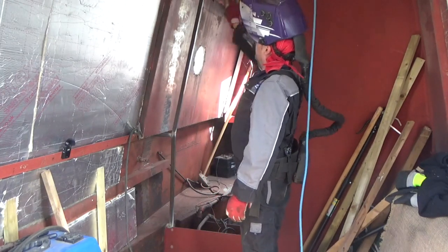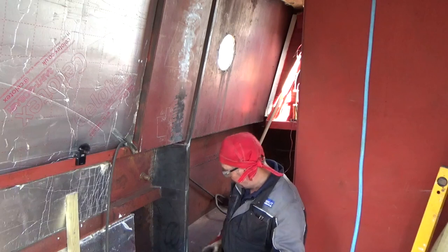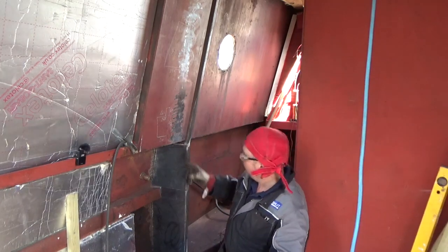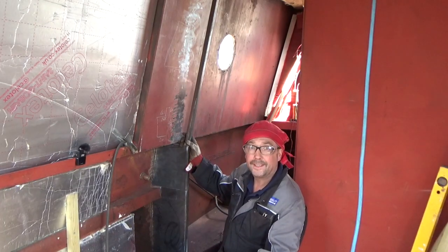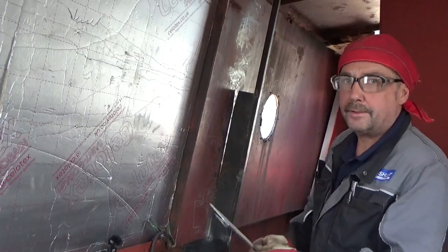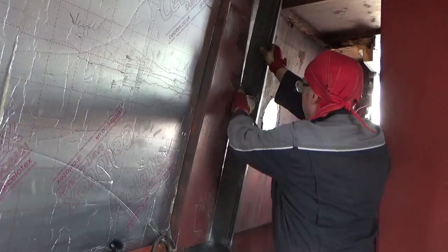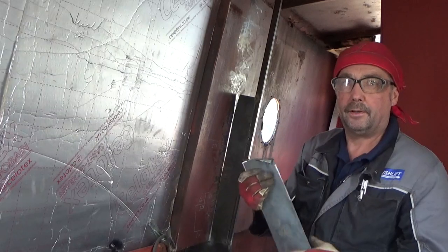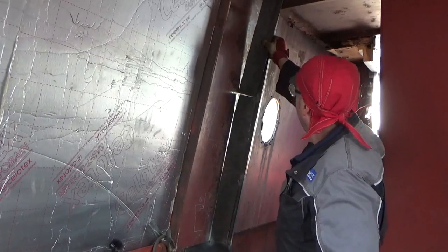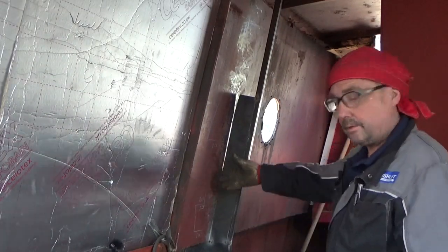Plate across the top, a head plate there - so we're going to cut some plate. We've got two plates in there, doing a scrap steel challenge again, all bits and bobs. One long plate up there, then we'll weld it in. It's warm out there - we've had to get the airstream on welding. That's my last bit to go up there. There are a few gaps but I'm just using bits and bobs up. None of this side will ever be seen again because it's going to be a pocket door - it's going to slide across.